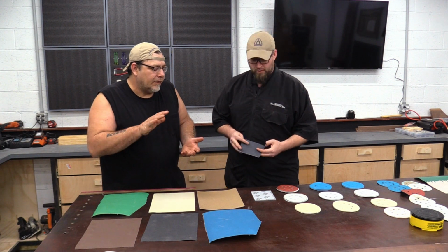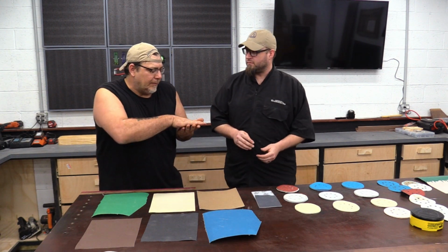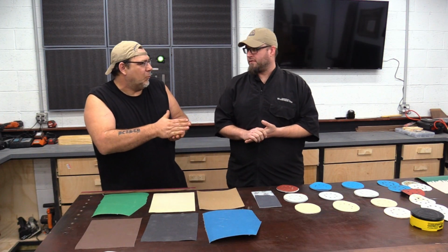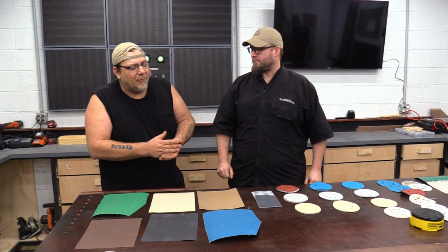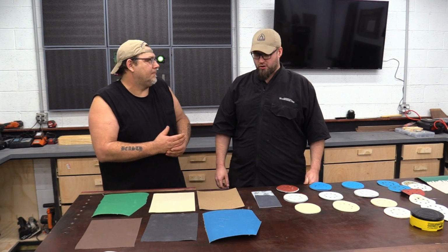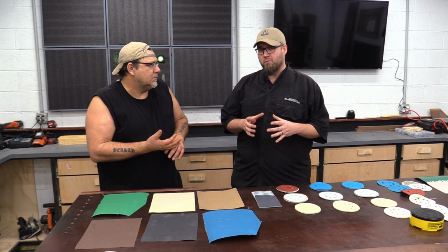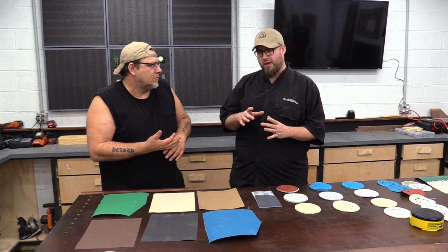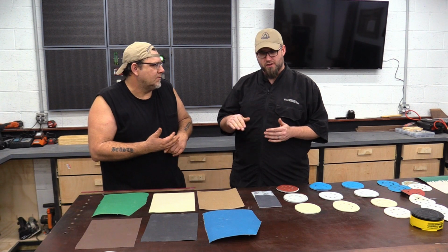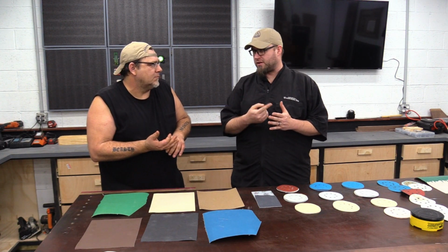Yeah, and the other thing I see a lot, and you tell me, I see people edge their sanders quite a bit, where they're sitting it up on the edge and they're trying to get rid of one particular spot. Well, the problem with that is when you finish it, it stands out like a sore thumb. Correct. And the other thing is that if you're using a random orbit sander, when you tilt it up on your edge, most of the time it's no longer orbiting. It's actually oscillating back and forth, causing zigzag lines rather than nice swirl lines.